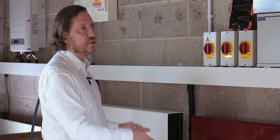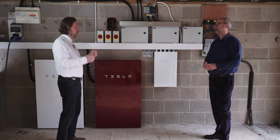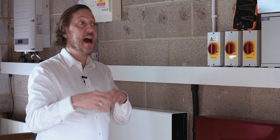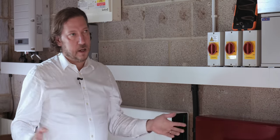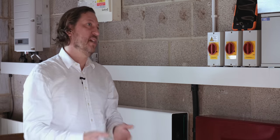You can set the Tesla Powerwalls to charge up with cheap nighttime electricity. If you're on a tariff where you pay more in the day than at night — which is very common for electric vehicle owners — you can top up your batteries with cheap nighttime electricity. You don't want to completely fill them though, because you won't be able to get the next day's solar in. So what the gateway does is make a prediction of how much solar it's expecting tomorrow, and tops up the rest with cheap nighttime electricity, leaving enough space for what it expects to come along. It's not super accurate — it's not taking in a weather forecast — but it can monitor what it's doing roughly at that time of year to get to a pretty good approximation.